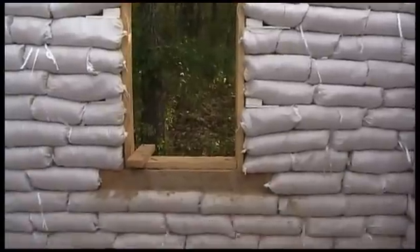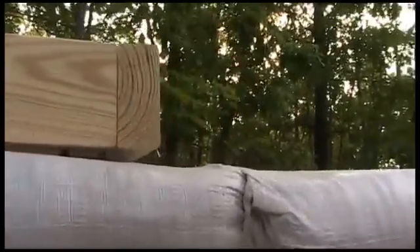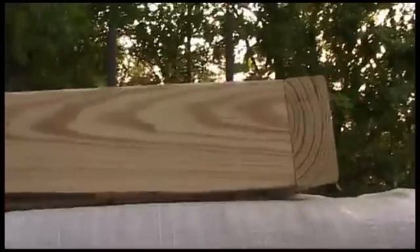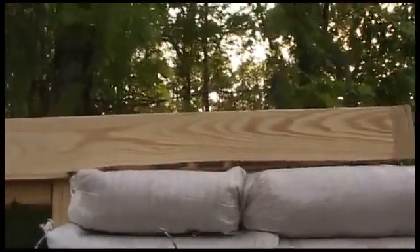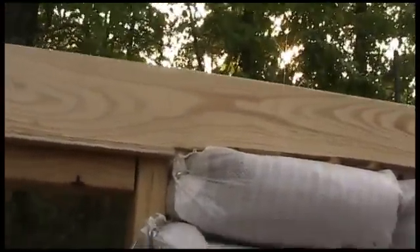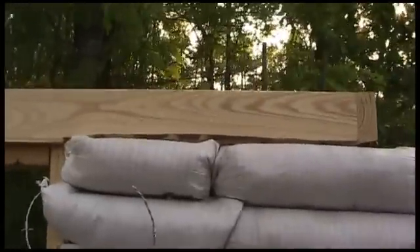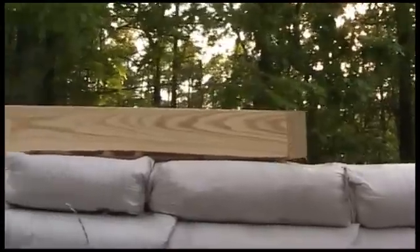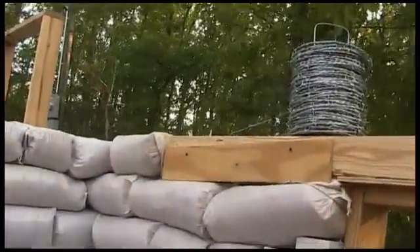This is the bathroom. As you can see, we're already to the part where we're going to put in the upper window sill. We're doing the window sills with basically a 2x4 mold and then filling it with cement. The difference between the official technique and ours is we're actually leaving the mold in place — leaving the wood there — and just putting chicken wire over that and keeping going. That gives some additional tensile strength from the 2x4s that will stay in there, and then you just keep going up above it.